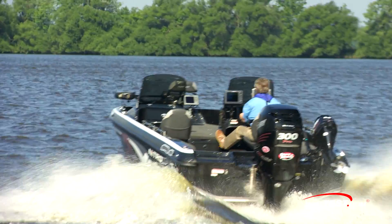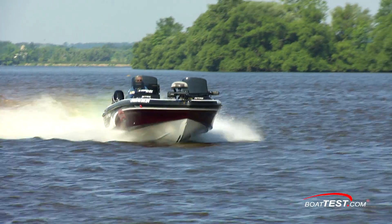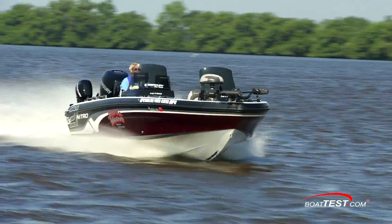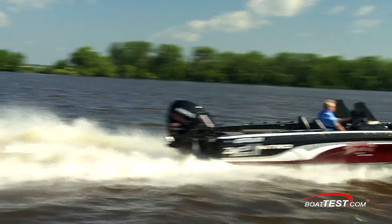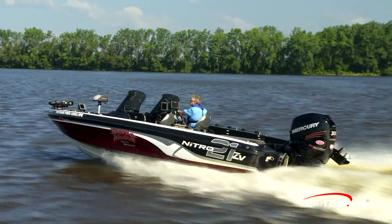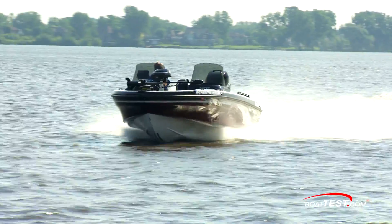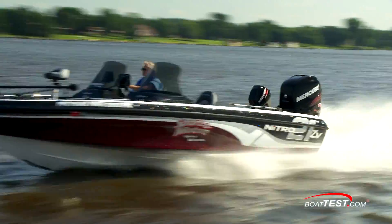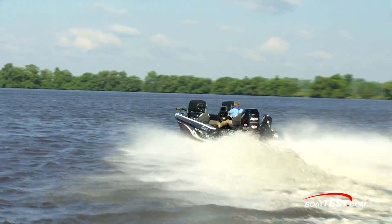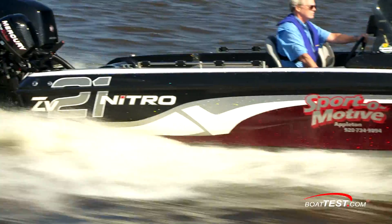With this engine offering two different gear cases — the standard and the pro — it makes for a difficult decision. For me, I'd always opt for the standard gear case with its beefier 5.44-inch diameter and increased durability over the perhaps one to two mile per hour speed advantage with the smaller pro 4.8-inch gear case, but that's just a personal opinion. I found no hesitation nailing any of the target RPM settings, and from mid-range speed, hitting the throttle showed no lag time.